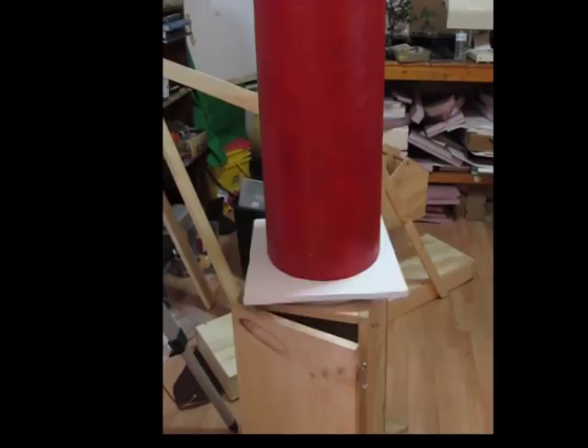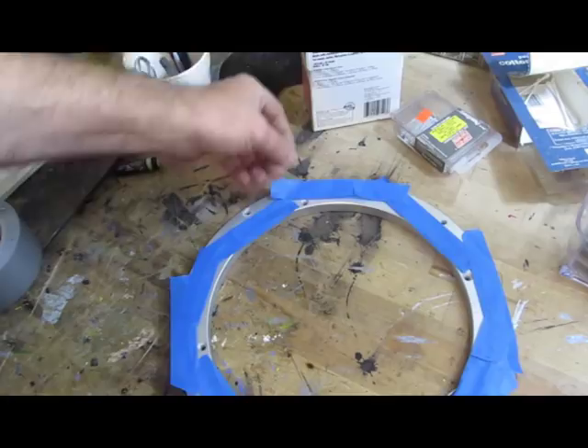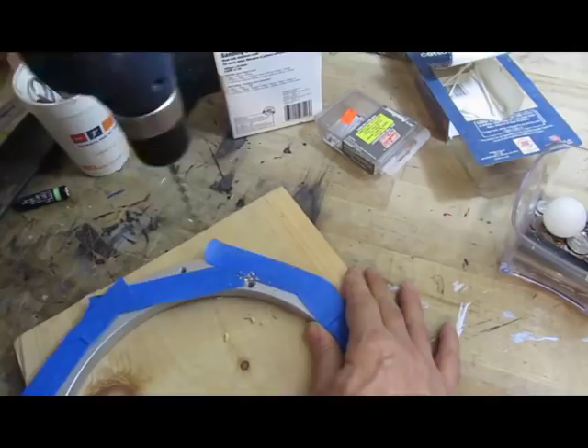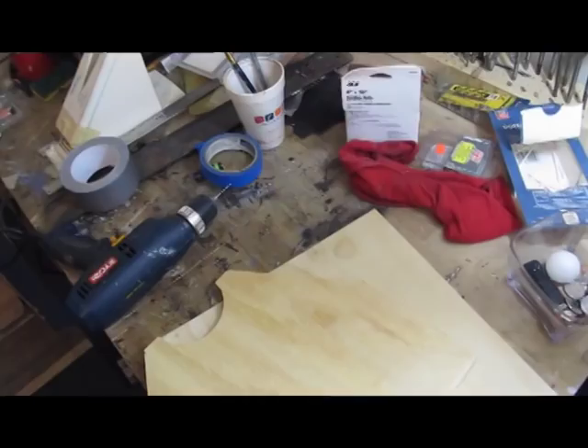Don't let the spark scare you — this is the hardest part. My Lazy Susan ring needed the screw holes opened up a little bit, so I just drilled them out to fit my screws. I wanted nice durable screws — I think I used tens. Notice I have tape over the bearings. If you're going to drill and make any wood or metal shavings, cover those bearings with tape. You do not want metal shavings to get in those bearings — it'll ruin them and grind them over time.